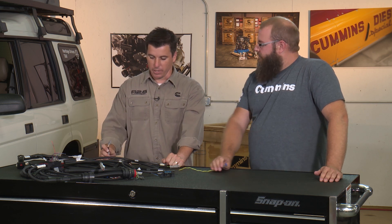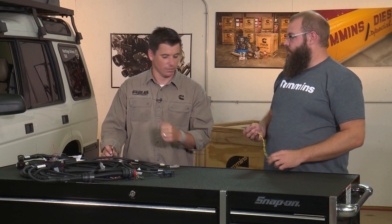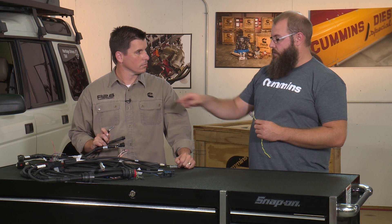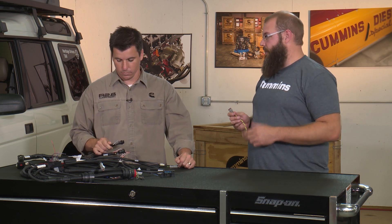You're in luck because on the engine we do have a three-pin connection point on the right in the front of the valve cover, much like we have in our test vehicle beside us. So what you're going to have to do is look at your manufacturer's drawings for your transmission harness and find the correct polarity of the two CAN wires, because there's a positive and a negative. You want to make sure you get those wired correctly to the three-pin on our engine, which is actually only populated with two pins. The third pin is typically used for shielding or a ground, but that is only necessary if you have a CAN bus that is extremely long — most vehicles won't be that long, so a ground is not needed.